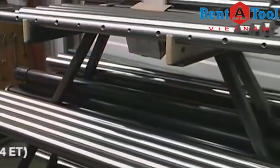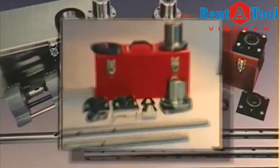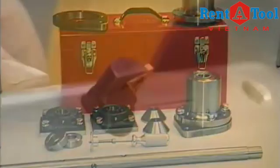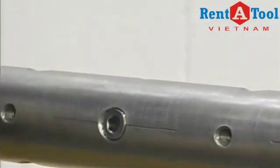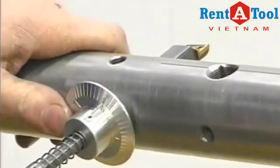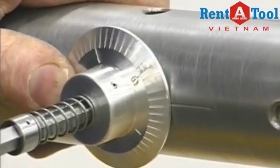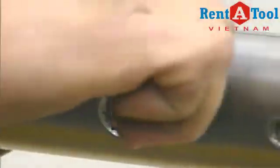Five bar packages are available ensuring maximum flexibility for any type of user. You may also customize your bar package with your local dealer to suit your applications. With our specially patented calibration tool, adjustment of the tool bit is easier than ever. Simply loosen the clamping set screw, insert the calibration tool, and turn the tool the required number of increments on the dial. Each mark on the dial advances the tool one one-thousandths of an inch. Tighten the set screw and carry on boring.